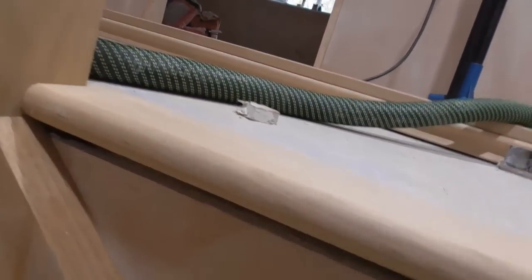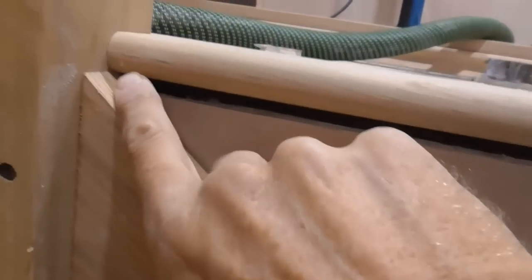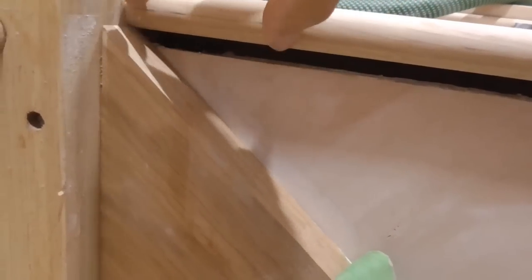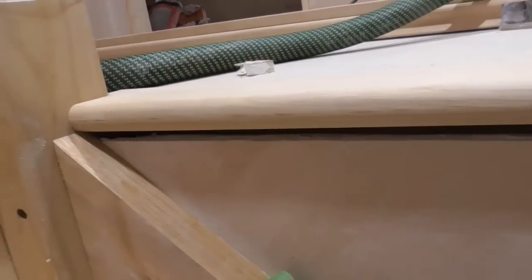Obviously what's happening here is this wall string is going to intersect this floor capping. So although this has got a slight bow on it, I've made it roughly parallel along this point, and all I should do now is probably just directly scribe. I know that this is a 42 degree pitch on this stairs, but what I'll probably do is just directly scribe, cut a little packer and directly scribe down a mark onto this nosing so that it fits perfectly where it hits this string. So I'll just do that now and then hopefully that'll fit. That's in there lovely now.